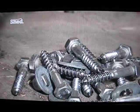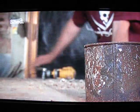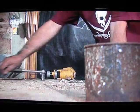Now there's any number of ways to attach a tabletop to a set of legs, but I've got my tried and trusted favourites. I love the semi-industrial look that coach bolts give a piece of furniture. Twelve coach screws is more than adequate to hold this top down.